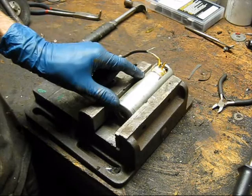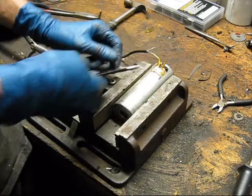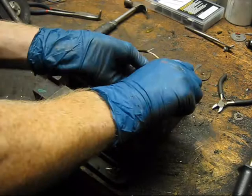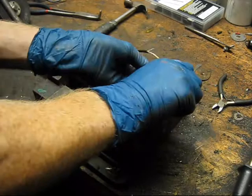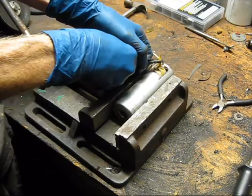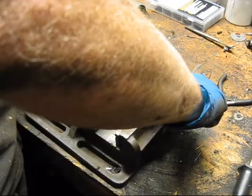I'm going to start peeling back all this casing and epoxy to get the wires exposed as much as I can. This is as far back as I want to pull this wire out. I can see it does go all the way down in there, but it's just not necessary to pull it back that much — I only want to pull it back as much as I need to, simply because I don't want to risk damaging stuff. I need to gently strip this. I normally like to use automatic wire strippers, but they don't fit in this tiny space. This one's not stripping as easily as the last one and it's starting to pull out — this is the wire right where it enters the magnetic coil, and I don't want that pulled out.